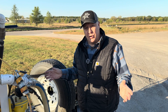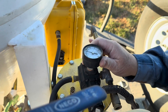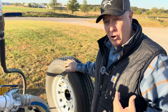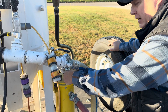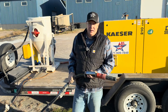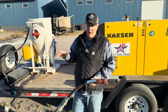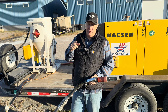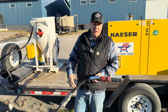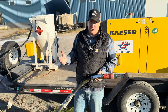I'm going to close this just so I don't get a pull of dirt and dust, but it is on and running. Looking at the canister — everyone has their personal preference. I like it about 80 to 85 psi. I see the last person had it at about 65 to 70, so I'm going to turn this up a bit for my personal preference. Pull the locking knob out and then turn it. I just uncoiled my hose and I'm ready to blast. Important to note: if you leave it all wrapped up you're going to wear your hose out much faster — drag it out, get the coils out, and you're not tripping over it anyway.